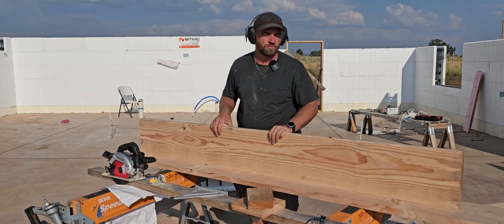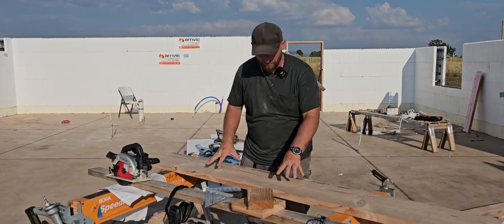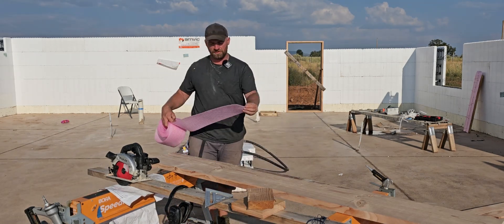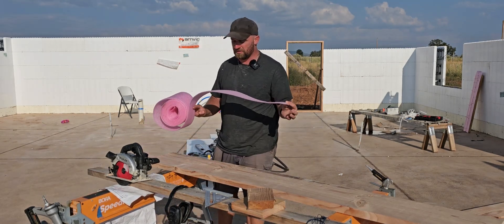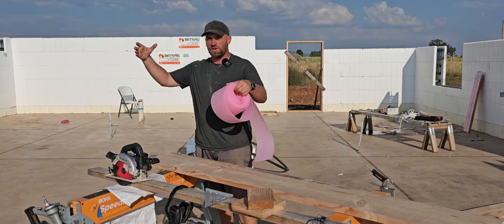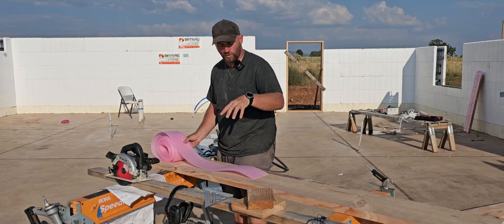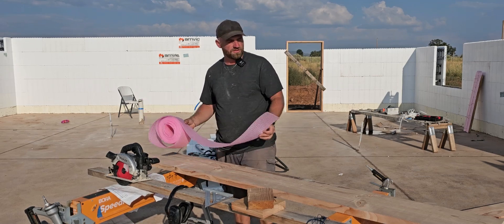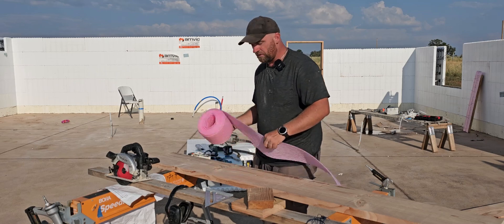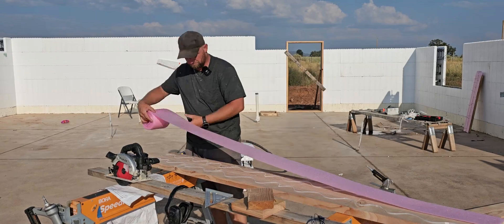I have one good solid upright but this is not treated wood, so I can't just let concrete flood right up to it and soak in water — it will warp. What's recommended is to put sill sealer on it. This is what you'd use if you were framing walls on concrete; it lays on the concrete and the framed wall goes on top. So they're having me use this on the wood so we can pour concrete up to it. I'm going a step further and adding acoustic caulk on the wood, then bedding the sill sealer in there — kind of overkill, but it keeps the bugs out.